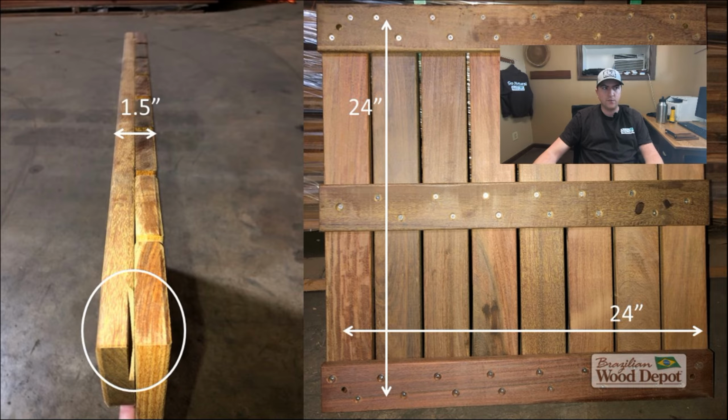Also, it has a little bit to do with how they're fastened together. I don't want to get into that either, but you have 8 boards, just like you see here. You have 8 boards that are fastened together on the back by 3 cross boards, and it is a very effective way to cover areas that you may not have a whole lot of height to work with, because let's say you've got a door frame that's only 2 inches above your concrete slab, so you can't put in a sleeper system or a floating deck. It needs to be much lower.